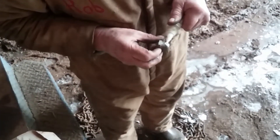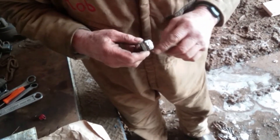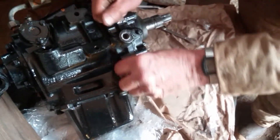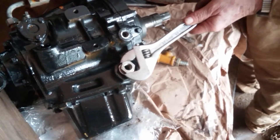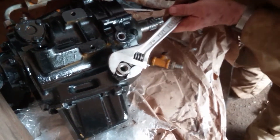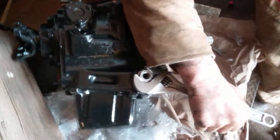I'm putting in a pipe plug or bushing so that one of the other crossover tubes will work. You want to use a pretty good pipe dope — this is stuff from North Dakota that we used on pipelines and on our trucks for oil when replacing fittings; it's special stuff good for petroleum products. If you use pipe tape, make sure you get the yellow and not the white — the yellow is also good for petroleum products, but I don't like it as well as the regular dope.